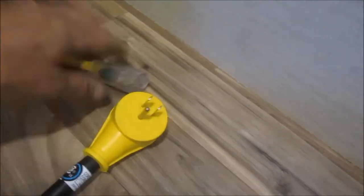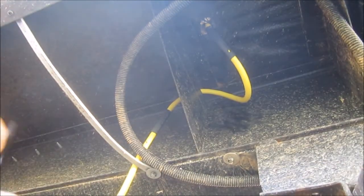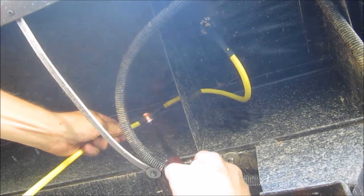And then a regular 30 amp RV plug will go into this adapter. Plug straight into the cord this way. The owner at another time is going to put hinges on this panel that he took out, so it'll be easy to unplug the inverter and plug into shore power if they're at a campground. I put a piece of shrink wrap here where it penetrates the floor, and I'm putting a piece everywhere I go through the frame, just as extra protection.